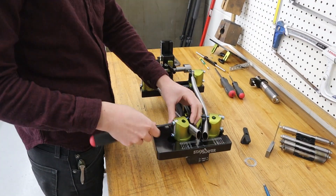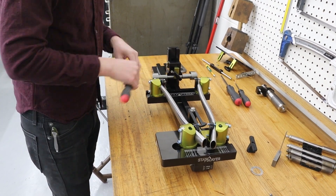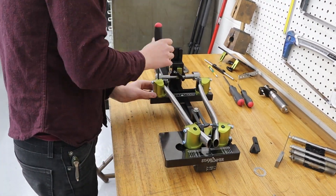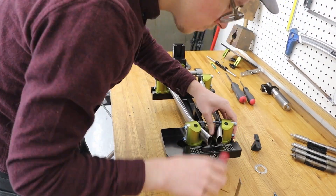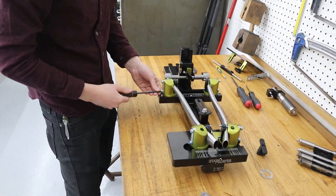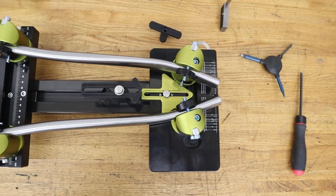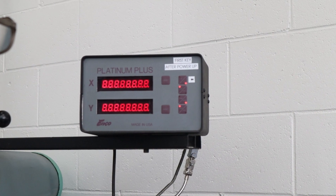These are off-the-shelf mountain bike chainstays. I load them in. On the rear end I have a dummy axle and the dropouts that I will be using on the bike — that allows me to set the spacing of these tubes lengthwise and widthwise. There's a millimeter scale at the rear end and a layout grid at the front end, so I'm using a machinist square in that layout grid. There are all sorts of features built into this that you can see in the Stay Slayer overview video, that help you get the tubes set up where you want them as easily as possible.